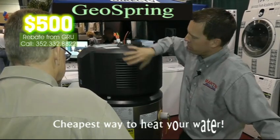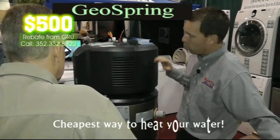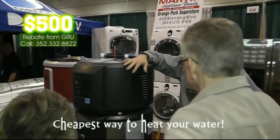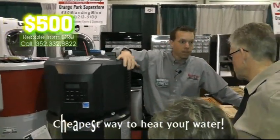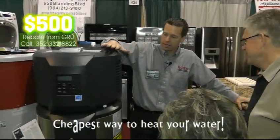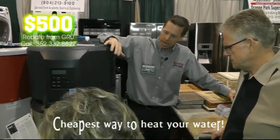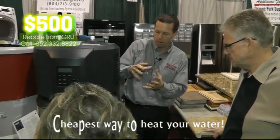If you needed to get one anyway, you'd be looking at installation and $500 for one. If you're just talking the difference in price compared to another new water heater, then you're talking a one-and-a-half to two-year payback. It doesn't create heat, it just moves heat, so it's actually cooling the garage off a little bit at a time — it's like a 3,000 BTU room air conditioner on top.